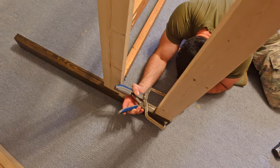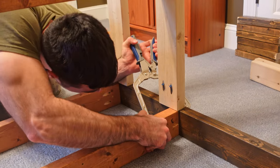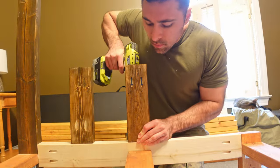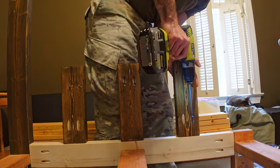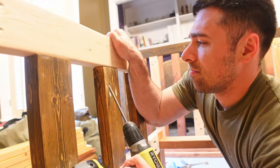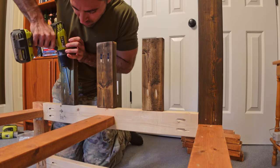To incorporate the armrests and the headboard, I need to replace the back vertical 2x4 of both end pieces. With all the boards now reattached to the new vertical support, I'm going to attach the rest of the vertical supports that will be used for the armrests. Now I'm going to attach the top of the armrests to all four of those boards. A downside I find with using pocket holes is that they can provide a little bit of flex in your overall structure. So to help counteract some of that flex in the armrests, I flipped one of the boards around so that the middle board was going the opposite direction of the two other boards, hopefully providing a little more stiffness to the armrests.